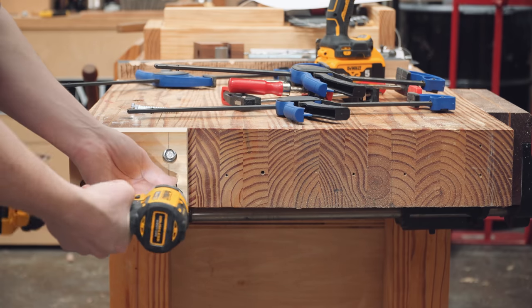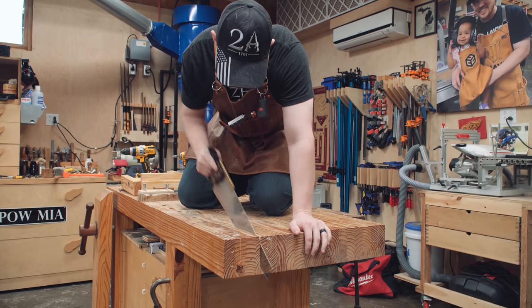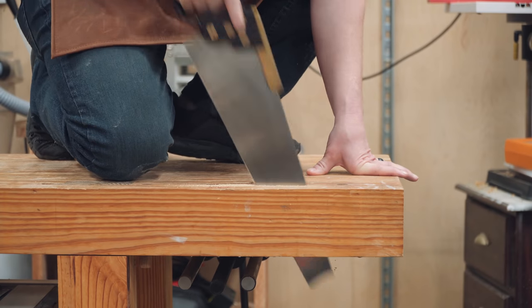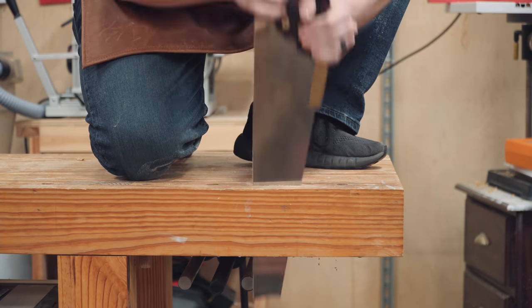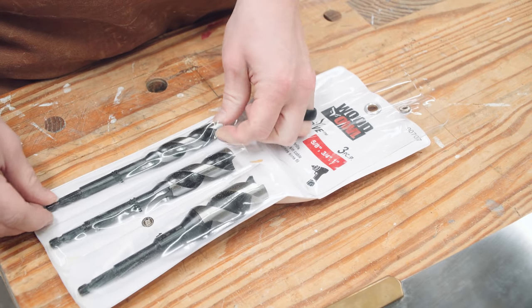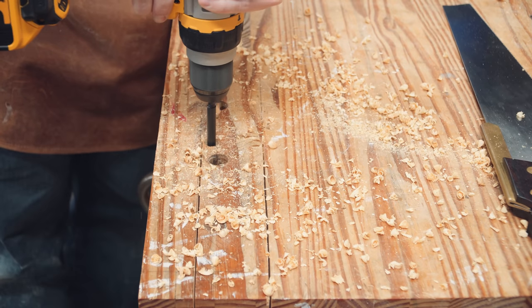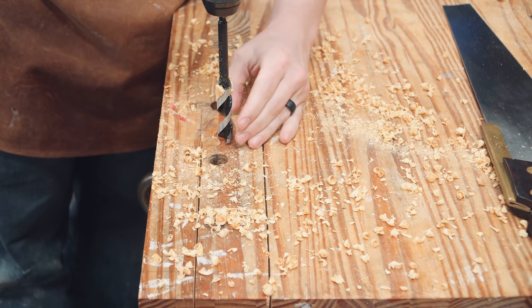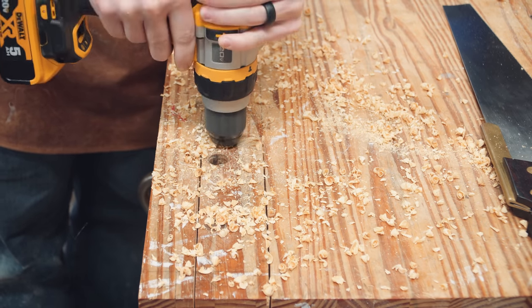After this is when the circular saw cuts should have been made. The circular saw cuts are completed with a handsaw, and I chose this particular saw because the tooth set is narrower than the width of the circular saw blade. This will allow me to complete the full depth cut without destroying my original reference face. These are Wood Owl Overdrive fast boring bits — I've heard really good feedback about them drilling straight, fast, and clean, so I'll be giving them a test with this project. I used the 5/8 inch bit to remove the bulk of the waste connecting the end of the cuts. It's the best of both a Forstner bit and an auger bit — clean as a Forstner bit hole with the ease of use of an auger bit.